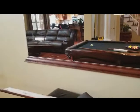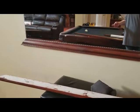My wood has dried and I'm placing it in its respective spots. This piece will be the bottom — I'm lining it up against here and nailing it directly into the wall. It's not going to go over the glass; it's just going to butt up against it. The smaller trim pieces will cover the edges. I got my first piece up, butted directly under the mirror, and put a few extra nails for added support in case the strips ever come unengaged from the wall. I used really thin nails with a tiny head so I can easily hide them in the frame, and I'll go back and touch up with stain anywhere I bumped with the hammer.